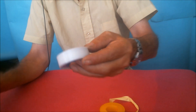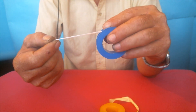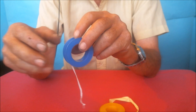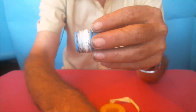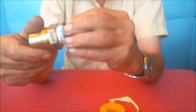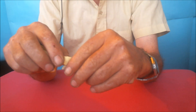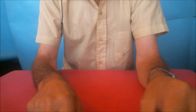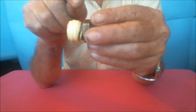With white PTFE tape used for water systems, we usually have to make many turns around the thread so it gets thick enough. This tape is very thin, which makes it useful for sealing PVC fittings that don't tolerate too much pressure and might crack if we use a thick sealant like hemp. With yellow PTFE tape for gas, which is much denser, we might need only a few turns. The important thing is to create a cone-shaped cover of tape around the thread — thinner at the beginning and thicker at the end, as you can see here.